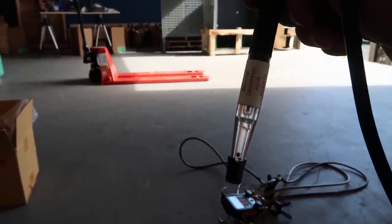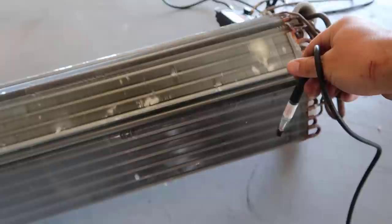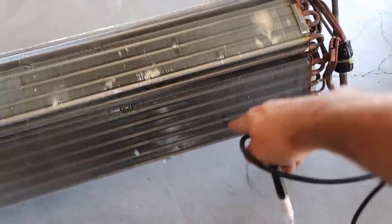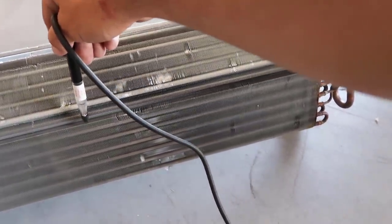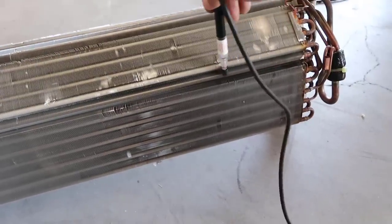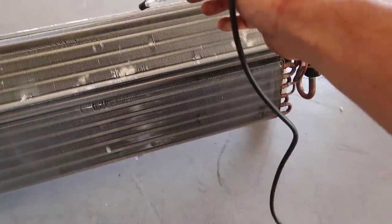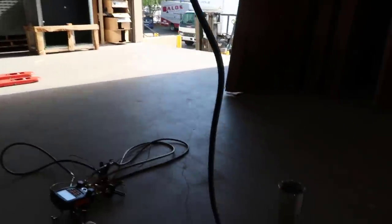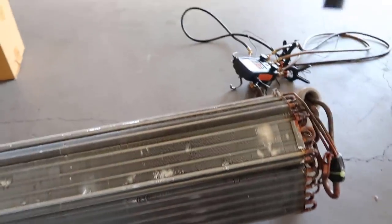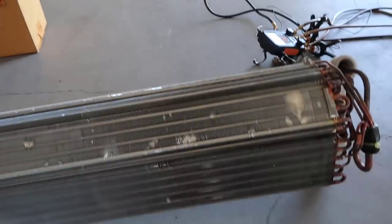I went ahead and replaced the pump with Brian. Before, we were getting about a four to five second lag. So if our leak is here, we would pass the leak and then it wouldn't indicate it had a leak until here — or you'd pass the leak up here and then check down here, and it would react to the leak five seconds later just due to the slow pumping slowly going down the hose. Now with the new pump in it and the ball hovering like it's supposed to, it picks the leak up way quicker.